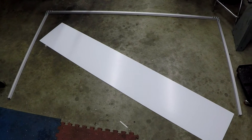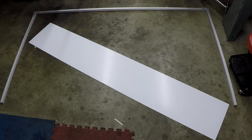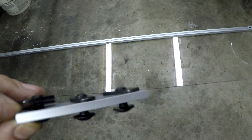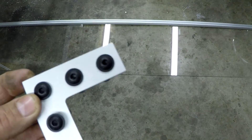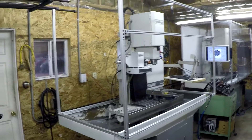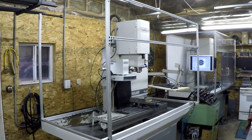We assembled just the outside edges on the floor. Now I'm going to slide the plexiglass up in there and then put the upper bar in to make the front of the machine. A little tip: when you put these angle brackets on, the easiest way is to start the t-nuts in the back first, put all your screws in, and then slide it into the slot — a lot easier than putting each piece in and trying to screw it in individually.